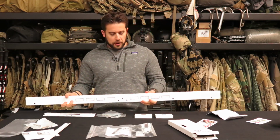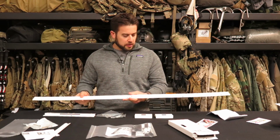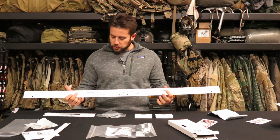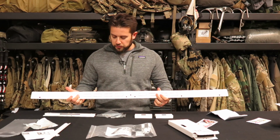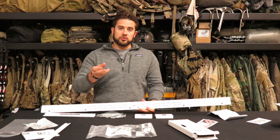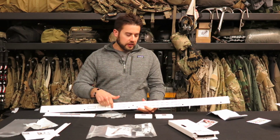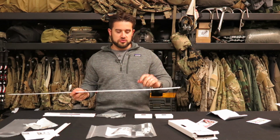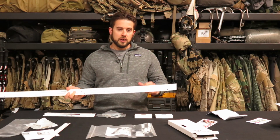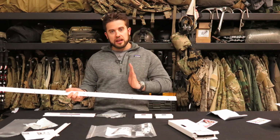So one gripe I've had with things like this in the past, and I'm kind of optimistic about the size of this thing too and all the different locations that are available for punch out with these, is that typically the door sensor or the contact for an alarm system is something you have to work your way around with these. So you'll wind up having to get a bigger size drill bit and drilling through these to open up that hole where the actual contact is coming from, if it's in that door side.